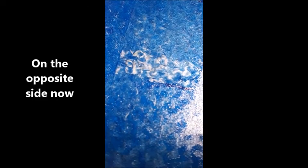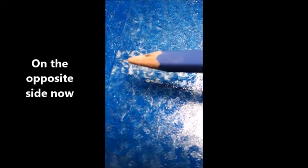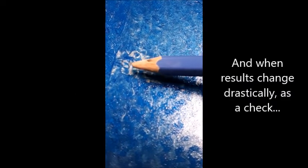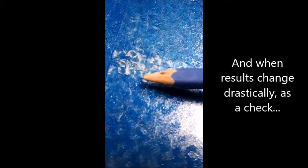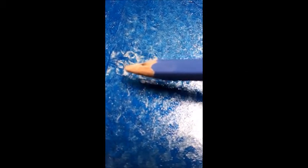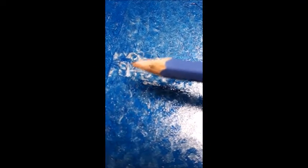Early in the spotting process, it's important to look at the master as well. You can see these marks here — particularly those ones right there — are indicating there's a really high spot, and this is down at one end. Basically, if you were to scrape based off the spotting you get on here, you'd be scraping the wrong places, because down here at this end, something is holding the master up.